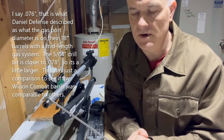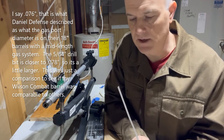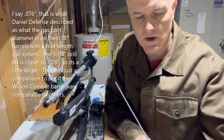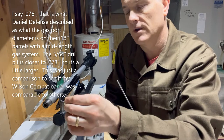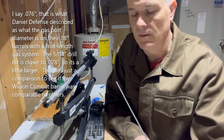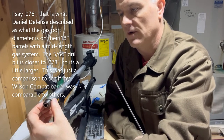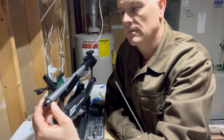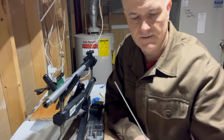I have a JP Enterprises double crush washer I want to try out. That also has a jam nut. That's another possibility. I'm hoping those things, a crush washer usually centers itself pretty well. The jam nut would screw into the thread, so that should also center. Like, the timing washer worked, put a nice snug fit while the Rocksett set up. So it was secure, but there was some play that could occur. When you tighten it down, it might slide. So I didn't really, at the time, devise a method for keeping the timing shim centered. So that's just something to think about in the future.